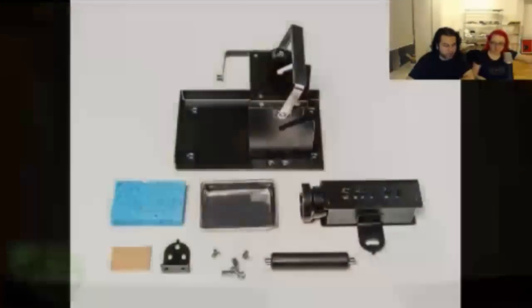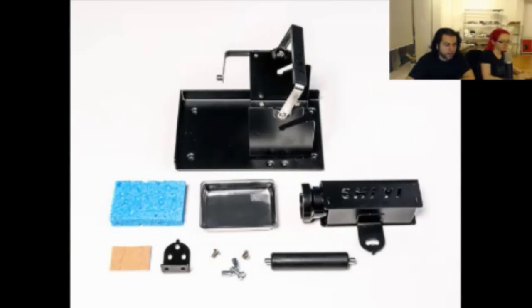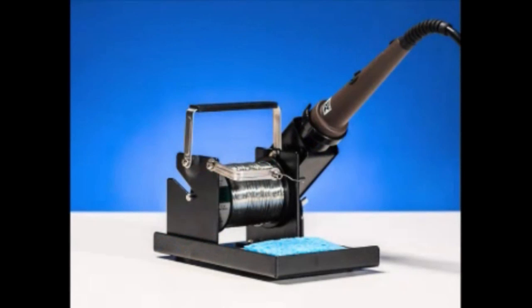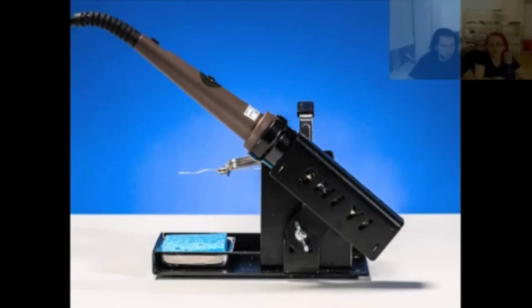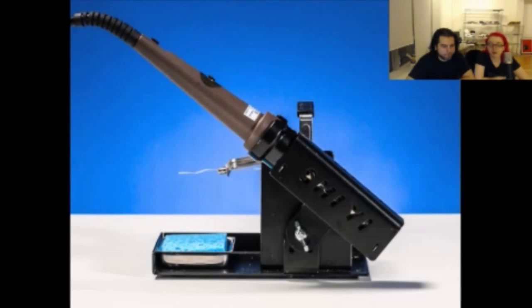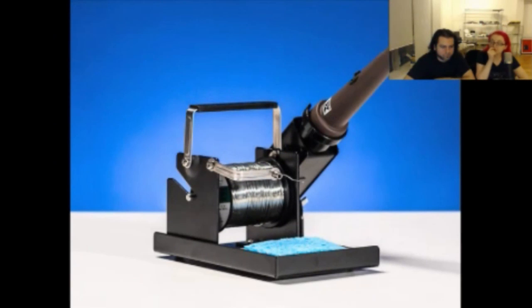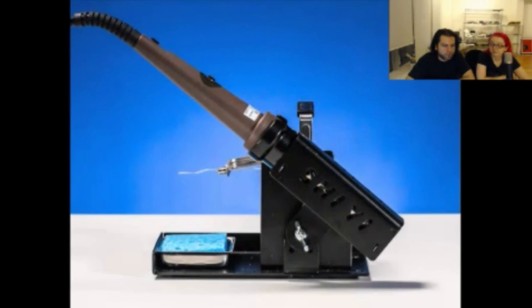Next up, we've got this awesome soldering stand. Someone commented in the chat already — look at these amazing photos of soldering stations like this. It's actually kind of better than showing on the overhead. So basically it's a really, really nice soldering stand. We have a basic one which is like a couple bucks, but even if you have a Hakko station, you might want to upgrade to having the soldering iron holder be one of these instead, because it holds the soldering iron very solidly. It's super heavy — weighs like a pound and a half, not going to tip over. It has a sponge and a solder roll holder with a little guide so you can feed solder through and it won't bind up. There's a little handle you can pick it up with as well.